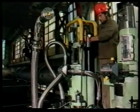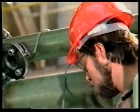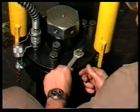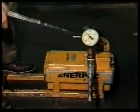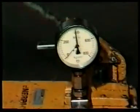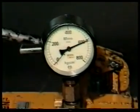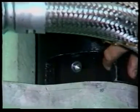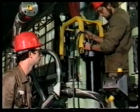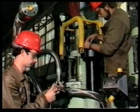Now we check carefully all high pressure connections. Keep opening the vent screws until the oil flows without air bubbles. Then raise pressure to 600 to 620 bar so that the nuts can be slackened easily. The nuts holding the valve cage are slack. Now we remove the jack and also take the nuts off completely.